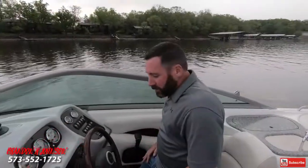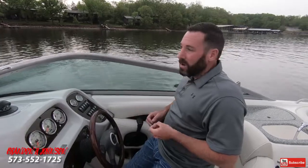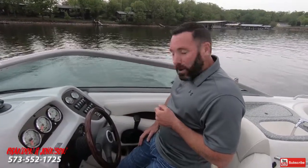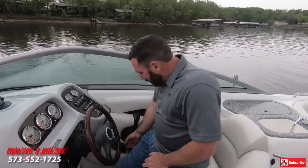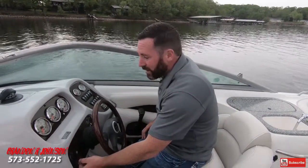Our battery switches are on 'all.' Three things if the boat won't start: click-click-click means dead battery. If you turn the key and nothing happens whatsoever — if it's in gear it won't start, if the battery switch is off it won't start. The number one reason why people call me after the sale saying their boat won't start is because of the kill switch right here. You accidentally bump it — it shuts off the charge to the engine, so it'll just turn over but won't fire. We've got it up, we're in neutral, batteries are on — fires right up.